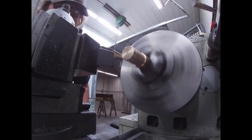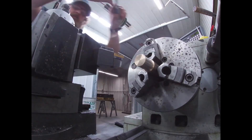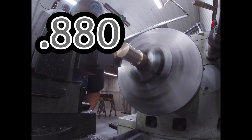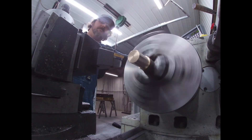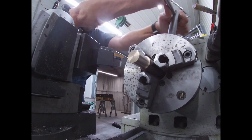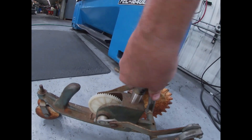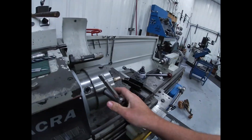Start off with a light cut again just to see where we're at — about 880, we're pretty close to our number. Remember, about 875 — that's the hole that needs to fit into, so maybe just a little bit smaller than 875 would work great. We got 875 on the dot there, and you can see it's starting to go in but it's pretty tight, so we're gonna put it in there one more time.